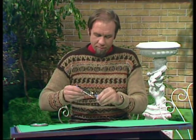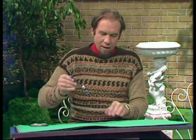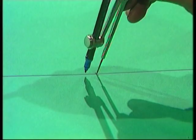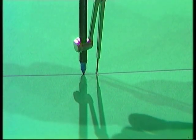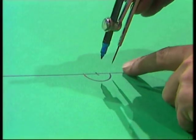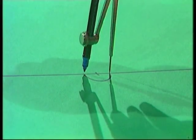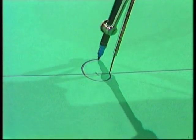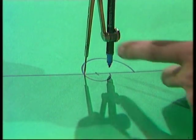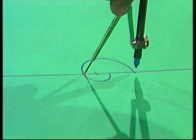Very easy if you have a pair of compasses. What you do is draw a line and find a point on the line anywhere, close the compasses up, put the compass point on the mark on the line and swing a semicircle round. Then you open the compasses so that the point on one end of that semicircle, the pin point is on the other — swing another out, and lo and behold, there's your spiral developing. You can keep it going in the same way, opening up all the time to develop that semicircle.